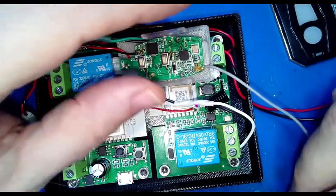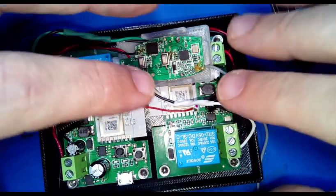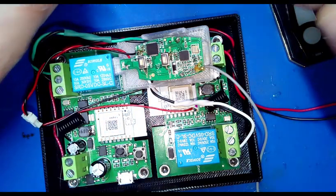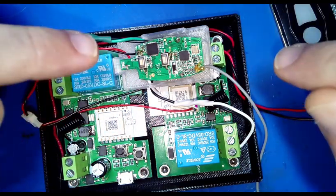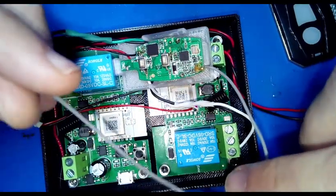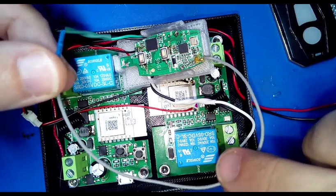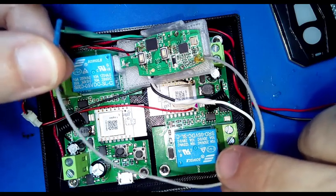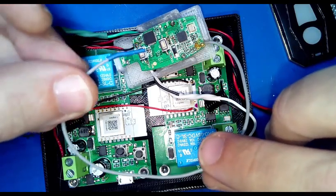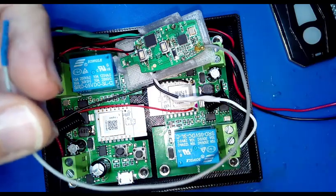So what I did is, with radio transmitters, you could use divisors of the full wave. So you'll hear terms like full wave, half wave, quarter wave. And in this case, quarter wave for 433 megahertz is about, I think, a little shy or around 7 inches long. So I took off their little chunky wire and I put just a piece of wire here that is cut to the correct length.